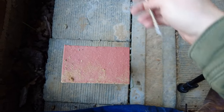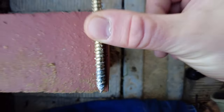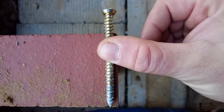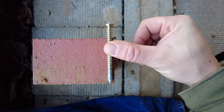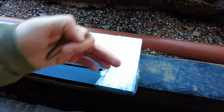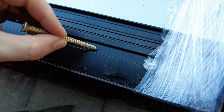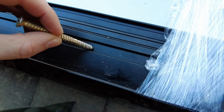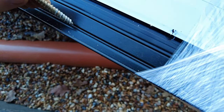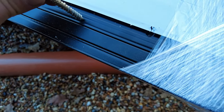Can you see the problem? If you can get your seal on there, drill through with a concrete screw or even a framing screw - that's never going to happen. Never. If you can get that to work, then you should be playing the lottery every single week. The manufacturer's recommendations for my particular seals don't recommend that you go through the thermal brake. They have specified exactly where you should be drilling through, something I've looked up in the technical manuals. I've got a couple of seals here for the doors. This one is for an inner opening one, so for this one I need to drill through here to fix it through and from here to here is 30mm - that is right on the edge of the brick. And then for this one, here's the thermal brake, I need to drill through that one. That one is outward opening and from here to here is 30mm, so it's on the edge of the brick as well.